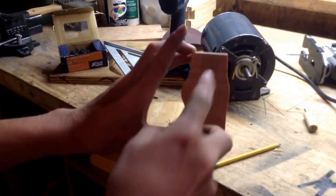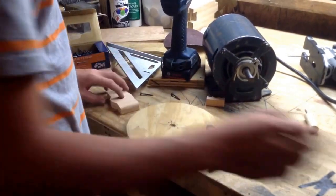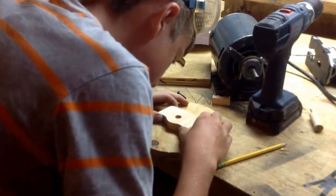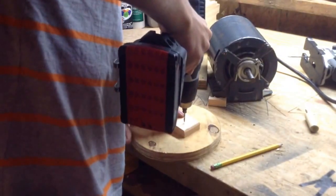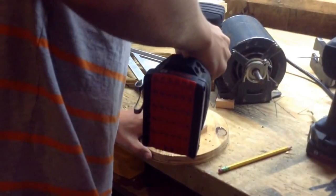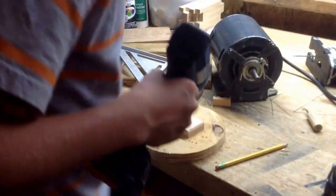I made this one bigger. The screws are going to go here and the set screw will go in here — I'll probably use the same inch and a quarter screw. I'm going to center this. Since it's a Forstner bit, it doesn't really help you center it as much. I counter-sunk this one even more. Also what's different on this one is the grain is running this way and not the other way where it would split out, so that helps a lot. I think this one will work just fine.